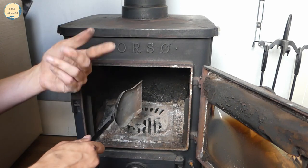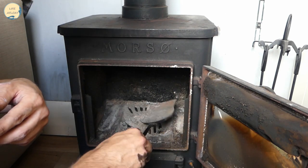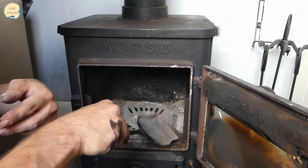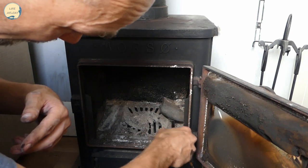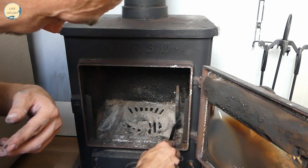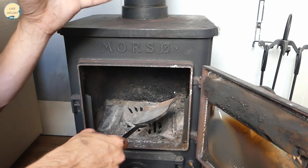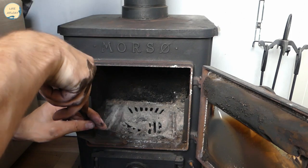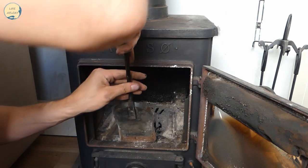What I will do is sweep the chimney flue as well - I'm not going to record that, I absolutely hate that job. But it absolutely needs to be done every few months, especially over winter. Now winter's coming up I'm going to just give it a good sweep. The risk is if you don't do it, the build-up of soot and dirt in there can actually catch fire. So it does need to be done. Also it can prevent your stove from running as efficiently.